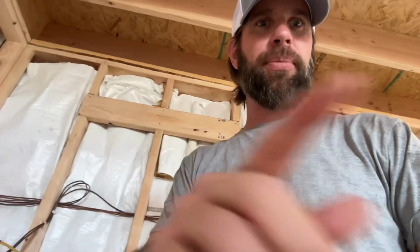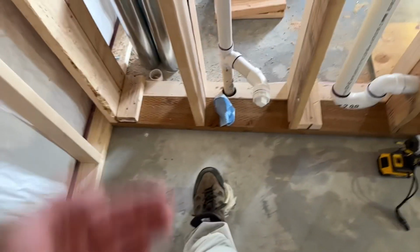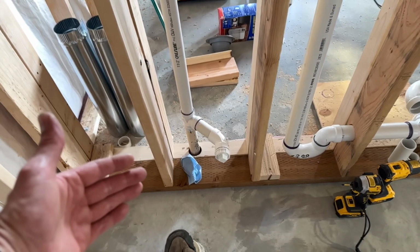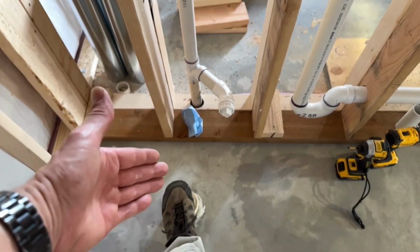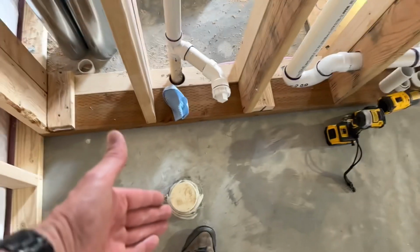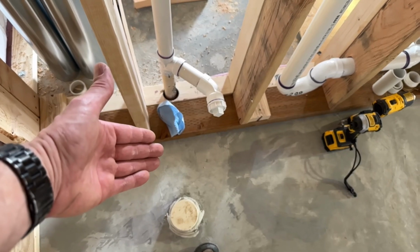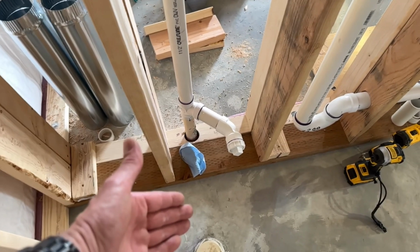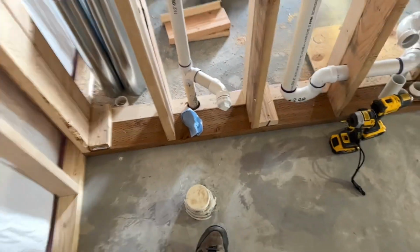And then, for example, toilets. Even a toilet has a standardization of 12 inches flange from the distance of the wall. However, I got a commercial toilet that requires a 1-inch water line, and I roughed in 12 inches for it. Well, I got the toilet, and it was an 8-inch back spacing. So my toilet was off the wall by over 6 inches, which really looks stupid. So I ended up building a subwall here.